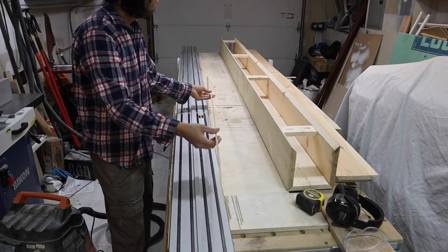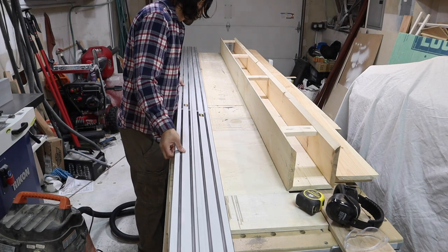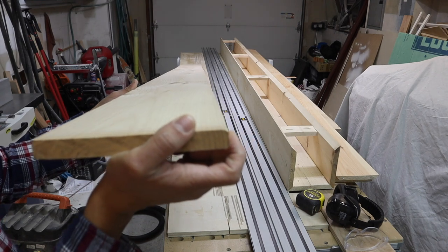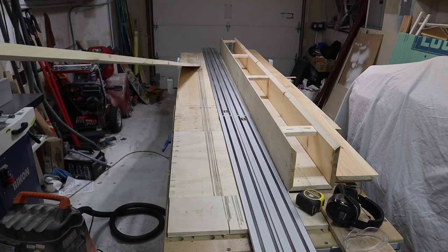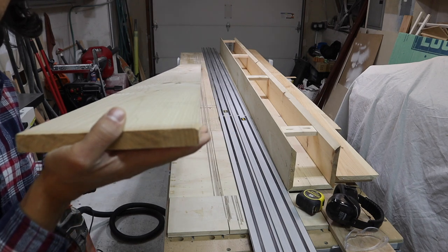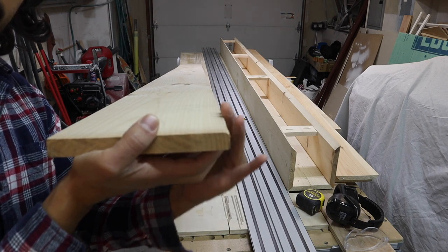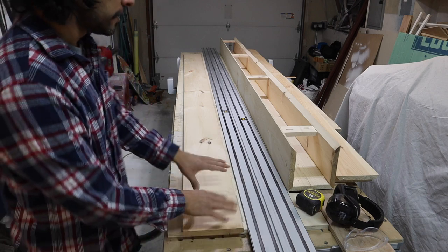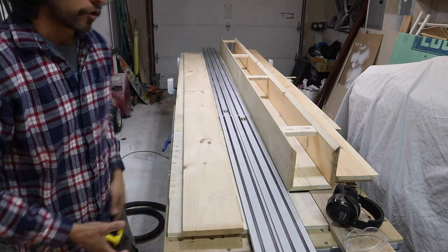We completed the cut. Here is the strip we cut off — let me move that aside and slide off the track. These tracks don't move; the rubber strips underneath really grip the wood. The crown is now gone. Looking down the edge, I have a perfectly straight edge all the way through — as good as it gets with connected tracks. That hump that was there before is completely gone.